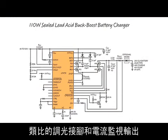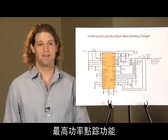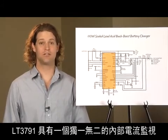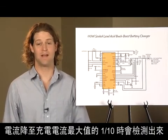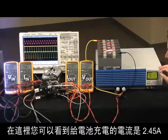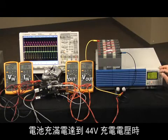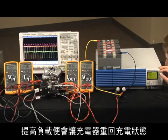The analog dimming pin and current monitor outputs can be used with maximum power point tracking for charging from a solar panel. The LT3791 has a unique internal current monitor that detects when charge current has decreased to one-tenth of maximum after the battery is charged. The open lead flag then changes state from charge to float voltage. Here you can see the circuit charging the battery at 2.45 amps. After the battery is charged up to its 44-volt charge voltage, the current drops off and the output voltage changes to 41 volts. An increase in the load causes the charger to return to its charging state.